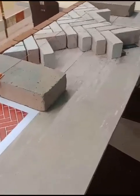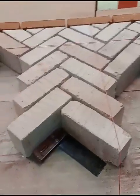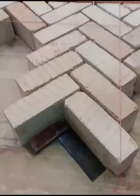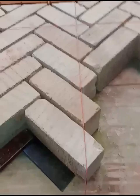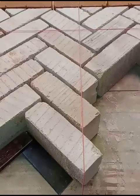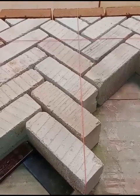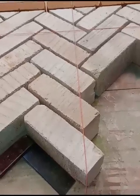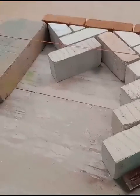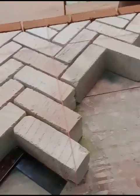I've laid a few more out just to make sure it's all working. As you can see, all the joints are pretty regular. Got the square in there, checking it as I went up. I've also put another line up vertically to keep the points of those bricks all plumb. Hope that was informative. Sorry it was a dry run, but I think it's a lot easier to demonstrate. Thanks a lot.